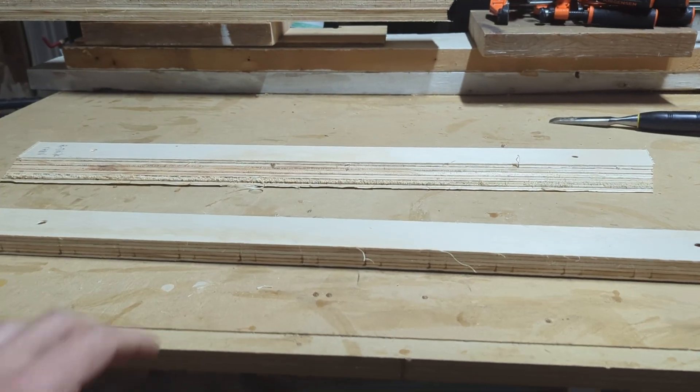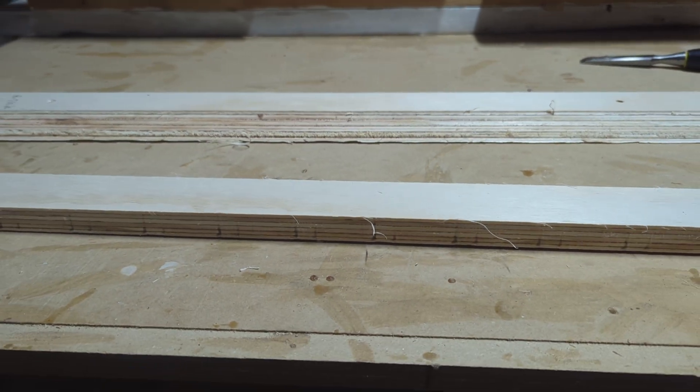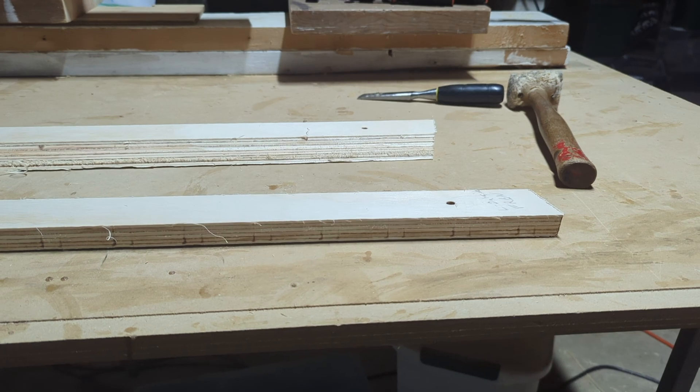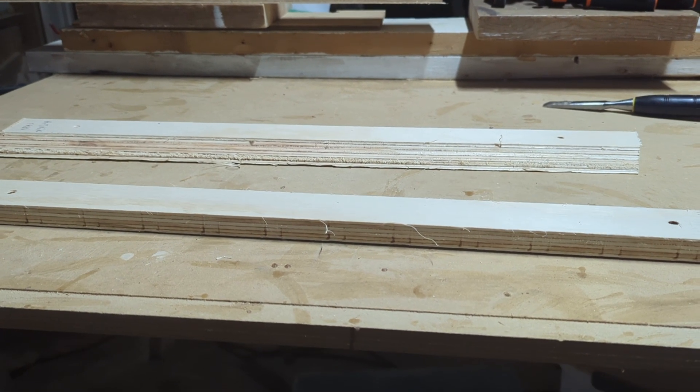By clamping and gluing two pieces of plywood together, this allows us to make a very straight part. Using dowels makes it very easy to put these parts together correctly. The material I'm using for my second prototype's framing or skeleton is three-quarter inch Radiata Pine plywood from Home Depot — it's cheap, lightweight, and looks good. The only downside is it may not be cabinet-grade for screwing into the sides. This piece right here is not straight — there's quite a bit of bend, and bend is what you want to be careful of with your framing, because it can change how your skins attach and allow gaps, which then turn into leaks.